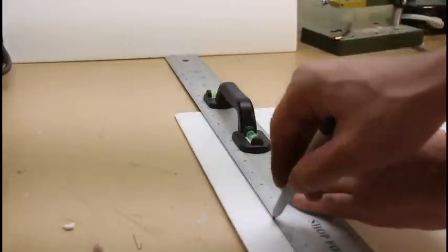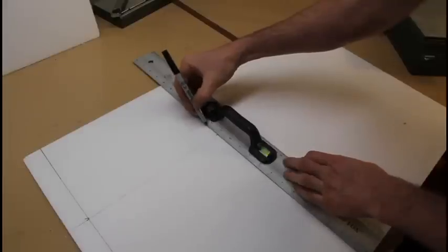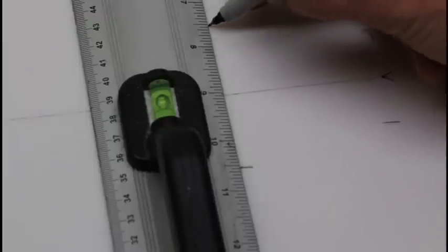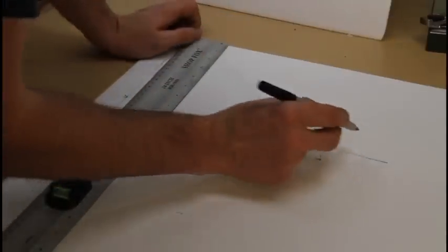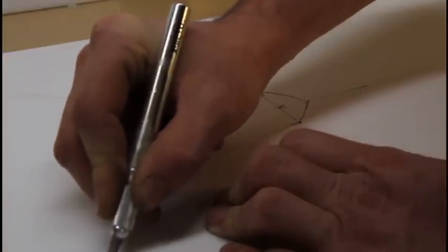Here I'm just taking an eighth inch foam board, peel the paper off of it, lay it out with a pen. I'm just using a straight edge. You can pause the video and start getting the measurements. They don't have to be real precise as long as it's symmetrical and around about the same shape — you should be in about the same ballpark. It's not a big plane, but it's still a lot of fun, pretty fast and very crash resistant.